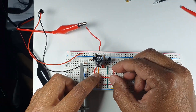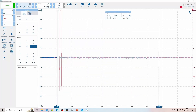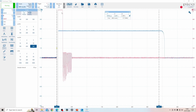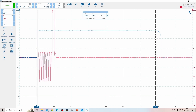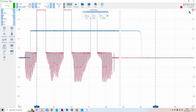On the board now I've got the improved circuit with R5 and Q3 in place. What this should do is that if we release the button, Q3 will hold this junction down to ground, so the user doesn't need to hold the push button closed and we'll get the full pulse width. Pressing the button, you can see the pulse duration was only this long, however the output stayed on for its full pulse width calculation - roughly 3.4 seconds.